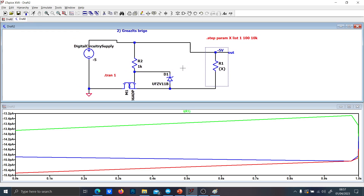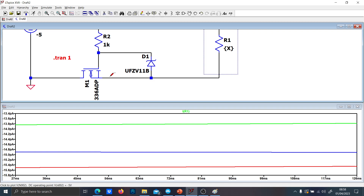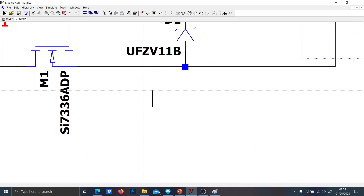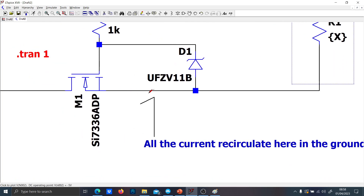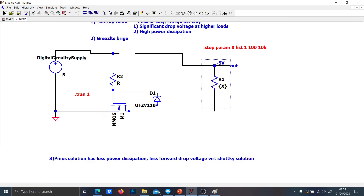It is quite strange — I do not recommend this solution because as you can see, no current is flowing into the load. We have only picoamperes, basically because there is no ground. I do not recommend this solution because you have a floating load voltage. All the current from here recirculates through ground, so at that node you're going to have other currents coming from other parts of the circuit because this is a grounded MOSFET, and you really don't want to use this solution.